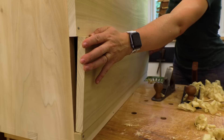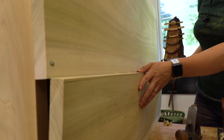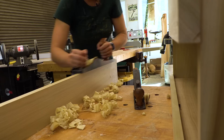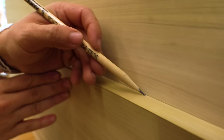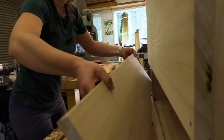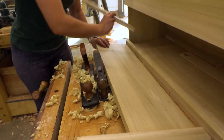So now we need to plane a little bit of an angle into this so that when it goes shut, it can still be flush at the top. We'll do that by taking the cutting edge of the tool along that edge. We're really close — we've got a little high point starting right here, getting much worse till here, and then it ends right here, so we want to focus our attention there. That's about as good as it could possibly get. Now that we've got that fit, we want to create our little battens to hold it on. We're just going to use a couple of offcuts and make sure that they go down in there.